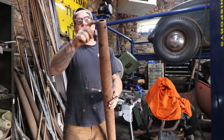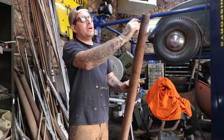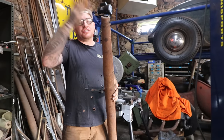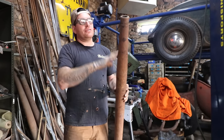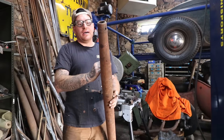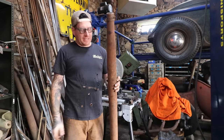If you chop off this end, this piece is a little bit of a pain to get out. I kind of forgot, and on the other side I had to fight with it a little bit, but this piece is actually sunken in a good 2 inches, and I think they heated it and dropped it in and then welded it, so it's hard to get out. You have to actually cut it up into pieces. So probably better to chop it down here. Because it's tapered on both ends, you're obviously going to want to go down to where the taper stops, or starts rather, and chop that off, and that'll give you your nice round, megaphone look at the end there. So that's what we're going to do in the chop saw here in a second.